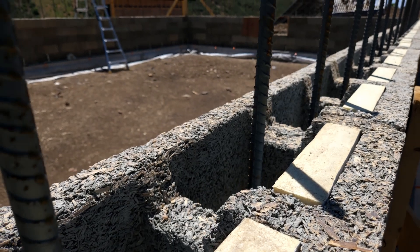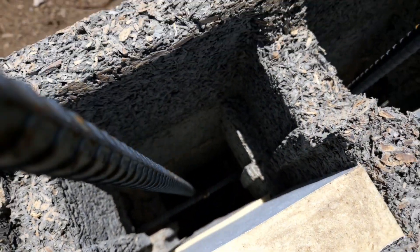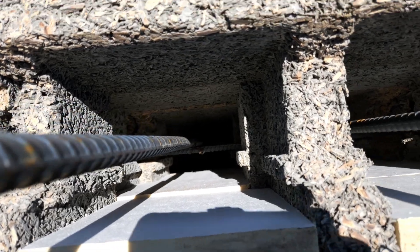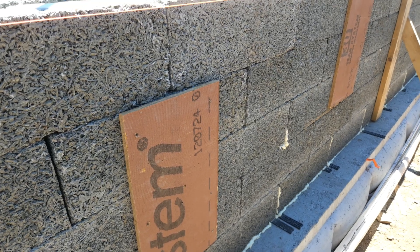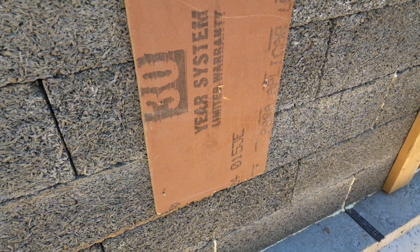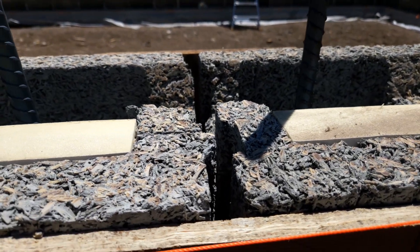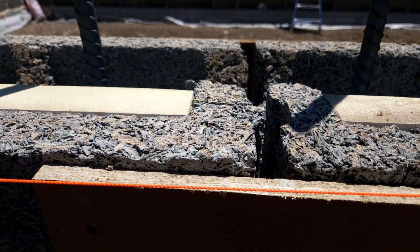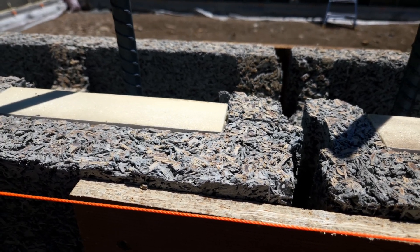You can see the wall there — you can look down the forms. We got all our rebar tied and we're pretty much getting ready for the pour tomorrow. Here are the spots where some of the blocks met and ended up leaving pretty big gaps — maybe a half-inch gap on the wall in a couple of places. So we figured to just go over those with plywood inside and outside. We checked the full length on this wall and it's the same length on all courses; it's just the way the blocks met up ended up being a little different. We're leaving it like this — hopefully it'll all be good and we'll find out tomorrow.